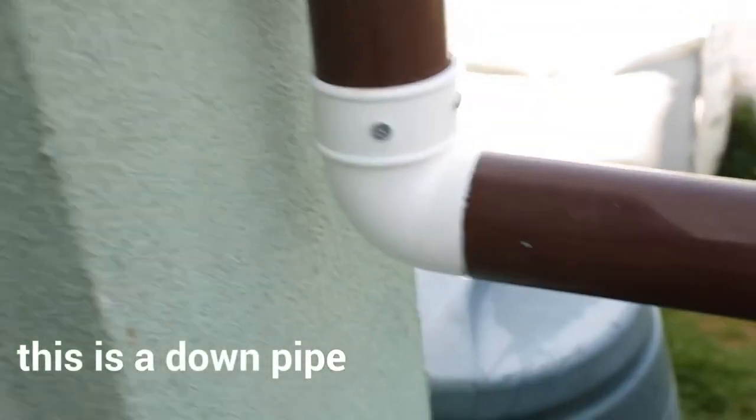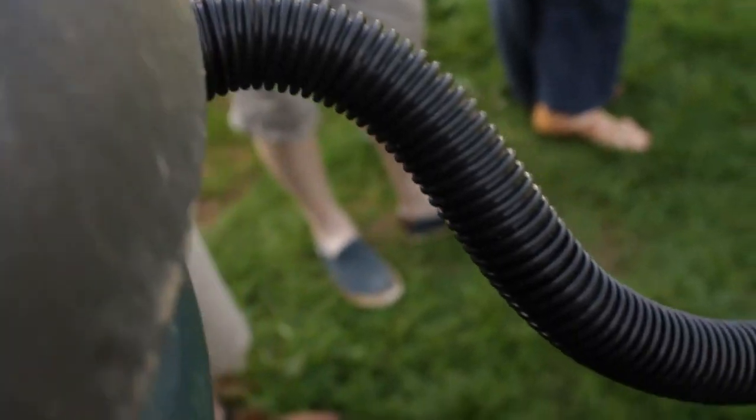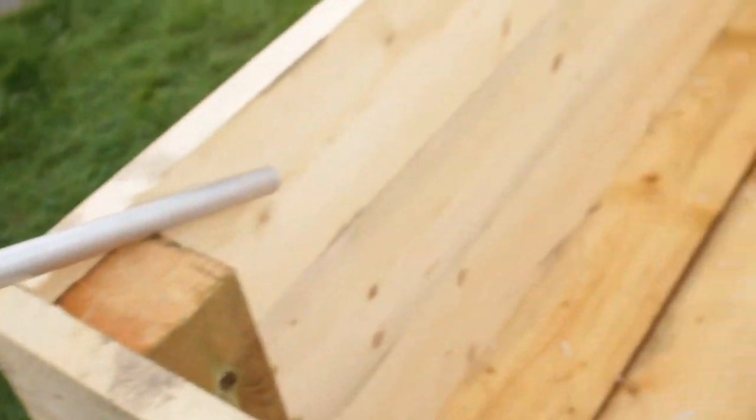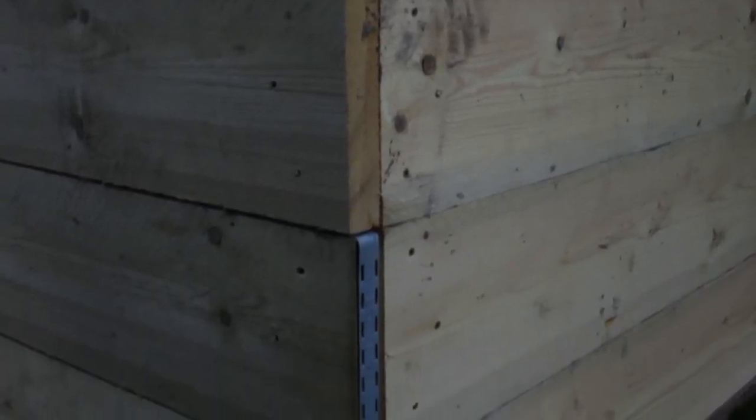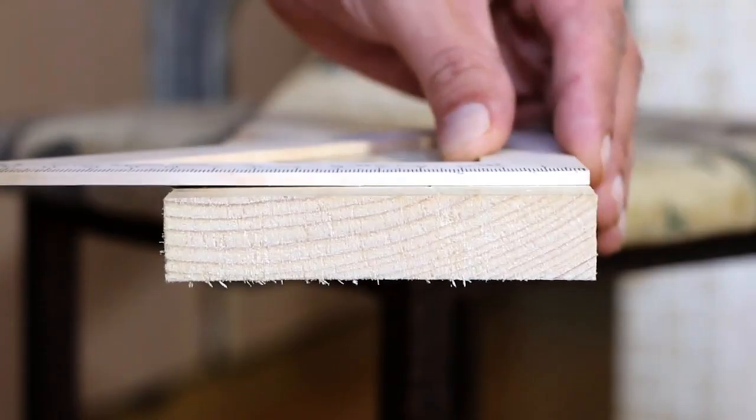The first stage of a rain garden is to have the downpipe diverted into a water butt that is connected to a stormwater planter box or a planting bed. You won't need a diverter kit because you don't want the excess to go into the drains when the butt is full. You want it to go to another part of the garden, away from the building, to be absorbed.